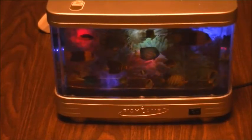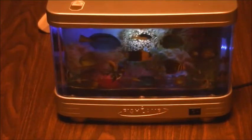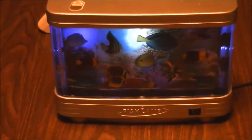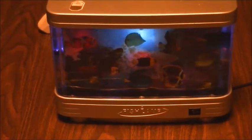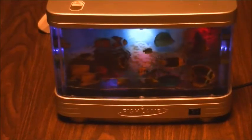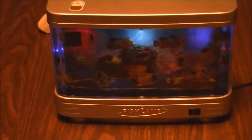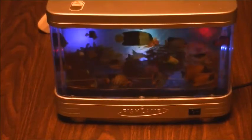Now, I know someone's going to ask this, so I'm going to tell you ahead of time. All the LEDs are wired in parallel, which means positive to positive, negative to negative. I didn't wire any of them in series. I've tried that before, and to take two of them and wire them in series really sucks the juice down really bad, which in theory, I guess it shouldn't, but it does. So I wired them all in parallel. This way each bulb actually gets its full 3.7 volts, full power. And with enough bulbs in here all together, there's enough division that even if I was over a little bit, it wouldn't make that big of a difference.